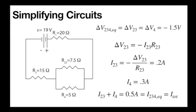I guess another thing that I'm not explicitly covering in lecture, because it's kind of hard to, is just tricky ways to draw circuits, which you'll also see plenty of in DL. One of my classic examples is kind of a butterfly looking thing where the battery is in the center and then the wires go off to either side. That's the same as if those two things were drawn like a ladder in parallel, like we see other places. So maybe that doesn't land with you right now, me just making hand movements. But what I'm trying to say is it's not always drawn as straightforward here, where it's obvious what's in series and what's in parallel. And so getting more comfortable seeing different circuits drawn in different ways is good. And it's never a bad idea to take a circuit, even once you've solved the problem, and challenge yourself seeing how you could draw it differently and have it behave the exact same way.